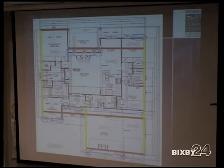There's three things to remember when you're doing your brace wall lines and putting your panels in. One, do I have enough bracing? So this one, yes I did. This one, yes I did. This one, yes I do. The next one is, are my panels within 12.5 feet from each end? And it's right on the end, and it's right on the end, so yes. The next one is, are my panels less than 25 feet apart, 25 feet on center apart? So those are the three checks.